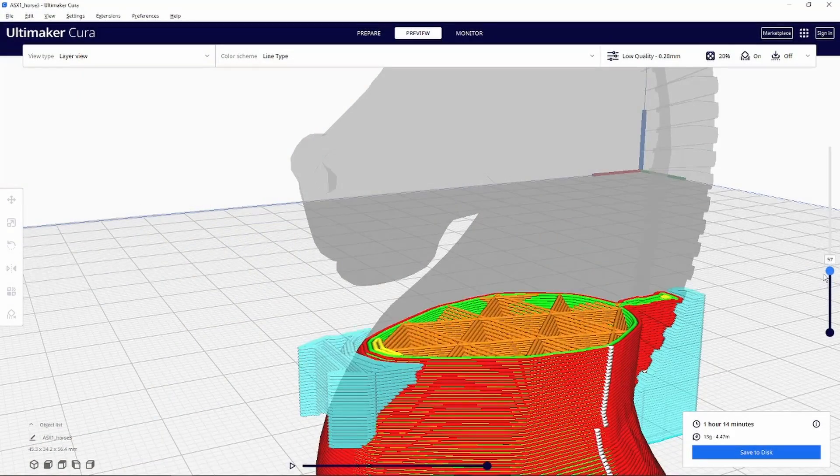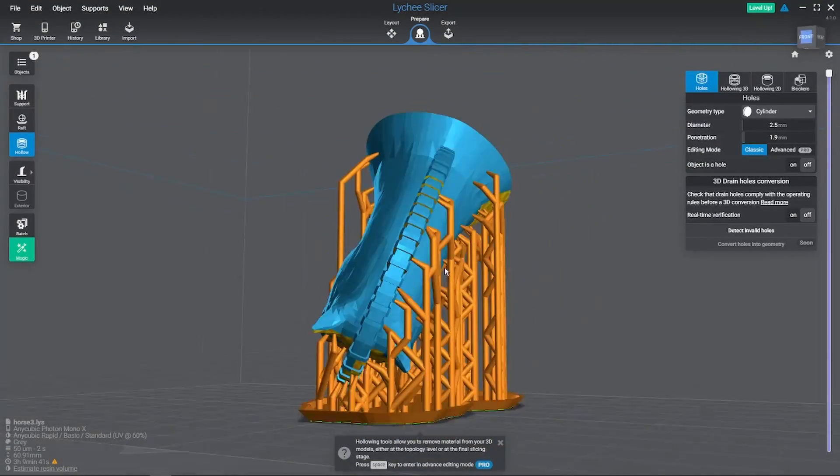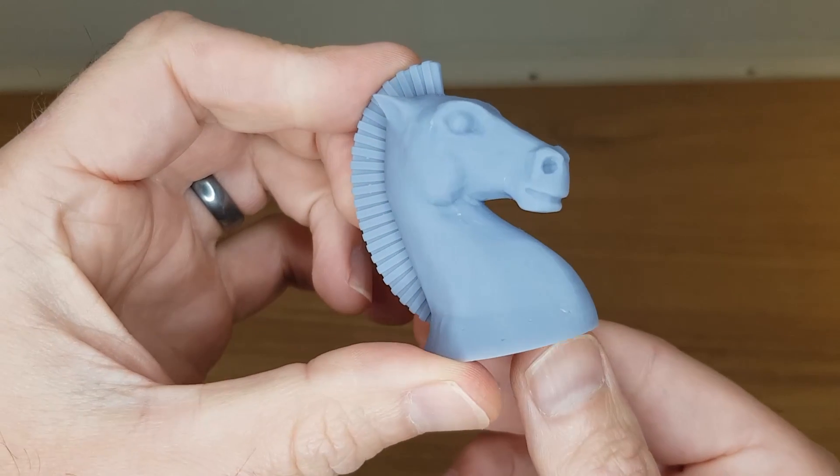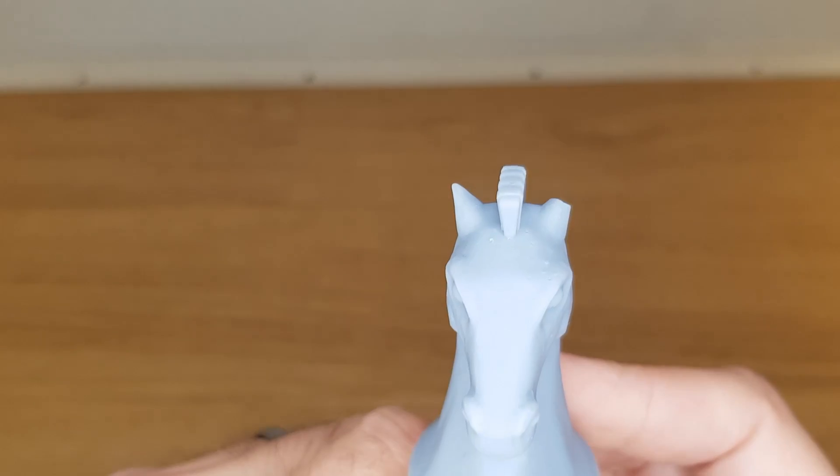The major thing that I had to get my head around was the fact that a resin printer prints upside down compared to an FDM printer. Supports on an FDM machine are there to hold up hot melted plastic against gravity from underneath while it cools. Supports on a resin printer are there to hold up very thin layers of cured resin from above until there are enough cured layers beneath them to keep things solid. That may not sound like a big difference, but it makes a bit of difference to how you use them. Learning how to orientate and support your 3D models can be the main difference between success and failure. The chess piece printed pretty well apart from the missing end of an ear, but my next few prints failed.